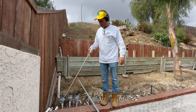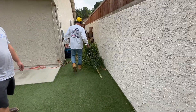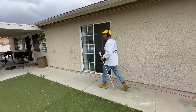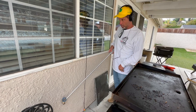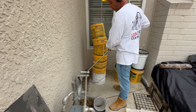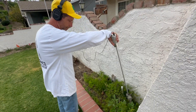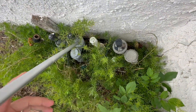We're looking for autofills. We get up to a sprinkler valve — these things leak all the time. You need to listen to every one of them; if there's water running through, you'll hear it. We're very systematic about how we handle the perimeter. We walk and hug the house, staying on the exterior, listening again and looking for anything we missed. Here we have a hose bib — we listen to that and move on. There are sprinkler valves all over this property. We listen to those and to any existing plumbing, which leads us around to the front of the house where we have the main shutoff.